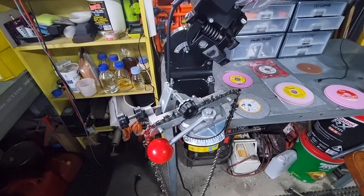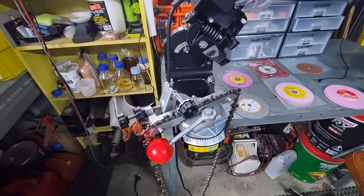You'll blue it. Now, when you do blue the tooth, you'll find out that it temporarily hardens it by about, or could be, 4 or 5 thou. So you don't damage the tooth, you actually make it quite hard, and you make it almost impossible to file. So if that happens, just make sure that you regrind it, and you should be able to use a file back on it.